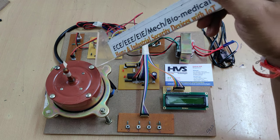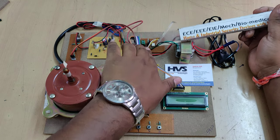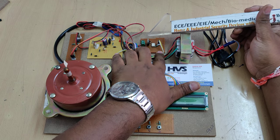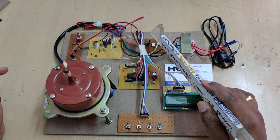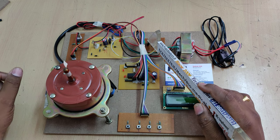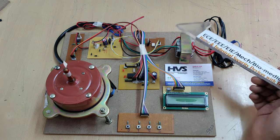On this board we can see two major components: the BT136 triac and the MOC3021 optically-coupled diac. In order to trigger the triac, we need to provide an AC voltage as a trigger pulse. However, the microcontroller can only provide a DC signal, not an AC signal directly.